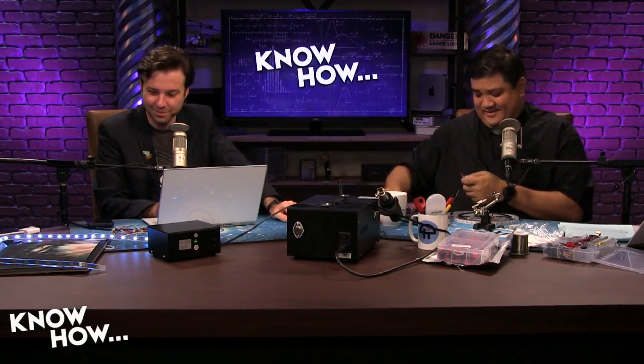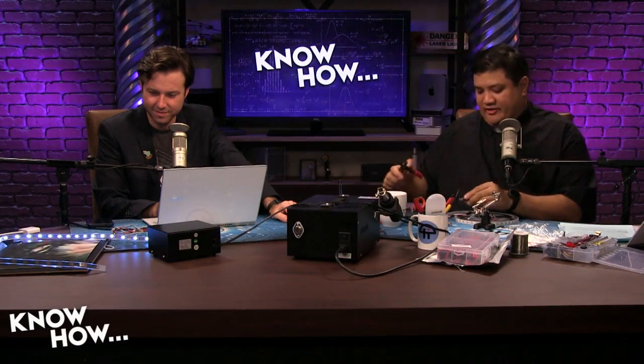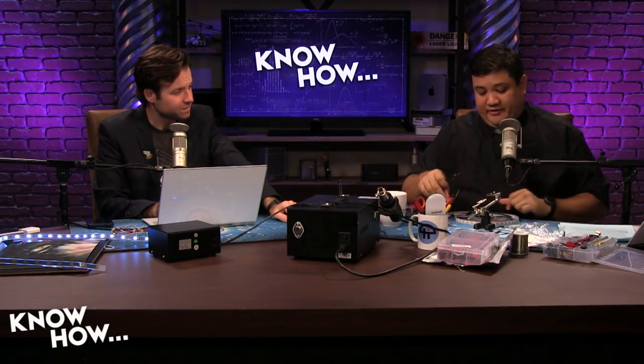That's a little sad, but all right. So what I'm going to do is give this power, and then connect to digital pin 7, and then we will be able to power this up, and I should be able to control this entire strip. Now, one thing is, how many LEDs did you say you put in the code? 37 LEDs. Okay, so there's way more on this. It will light up the first 37, though. That's good. Well, I can always adjust the code to reflect that, if you want to just take this length of LED.